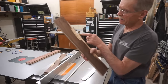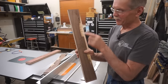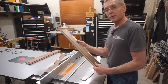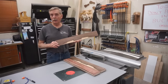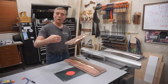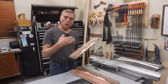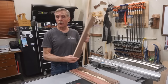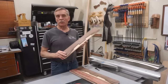And I gotta say, that right there is cutting it a lot closer than I'm comfortable doing, but as I like to say, it's better to be lucky than good. And now these blanks are ready for rough trimming on the band saw. Keep in mind, if you're cutting these out with a jigsaw, pay extra attention to how you handle the jigsaw itself, putting even firm pressure straight forward or flexing it a little bit to get the blade to deflect out, because with this thicker workpiece, it's a lot easier to deflect the blade the wrong way and actually spoil it.